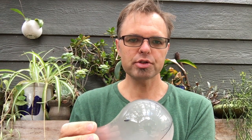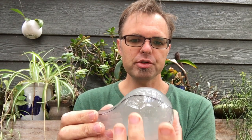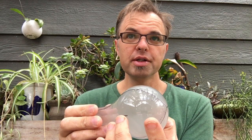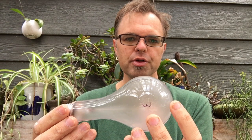So we've devised a way of doing a three-part mold, which just makes the success rate of these, especially for first-time mold makers, much greater. If you do a two-part mold, the failure rate of your first-time mold is much higher. So if you divide it in three, it's just a lot more foolproof. You're able to have a successful first mold-making project.